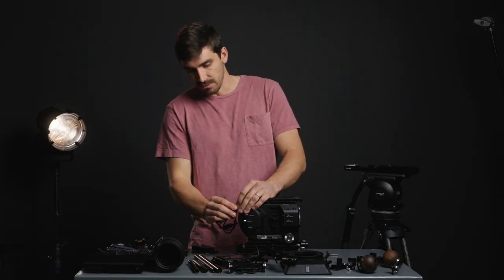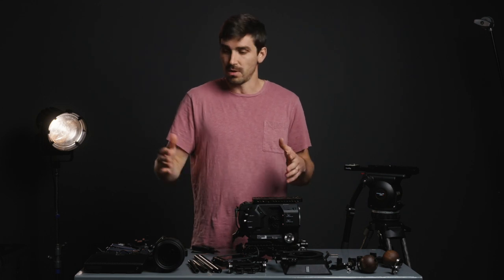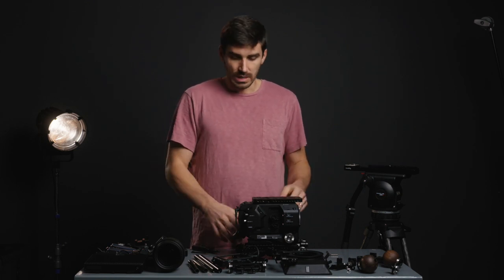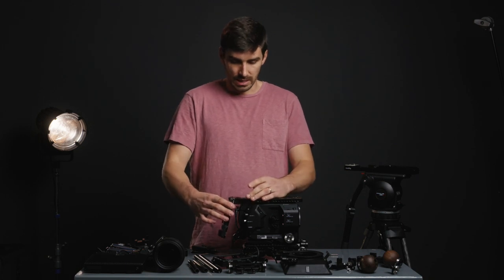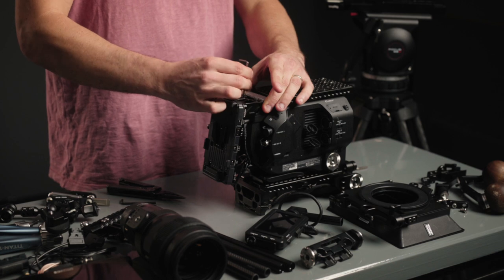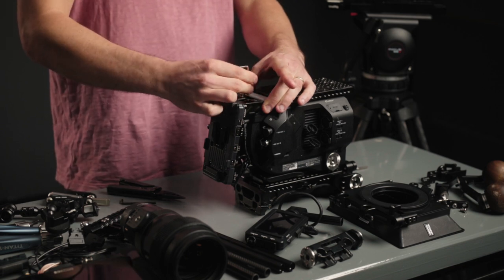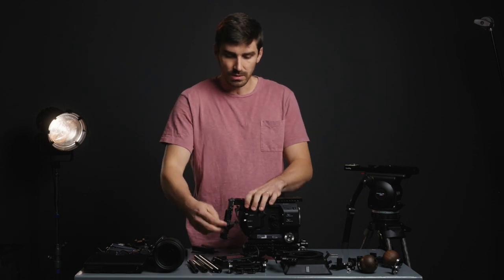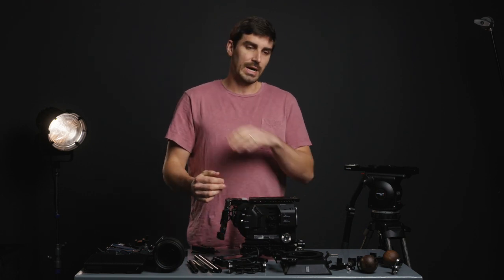It was a couple of years ago now where I transitioned from normal batteries to V-mount batteries, and V-mount batteries allow me to run everything off of them — my monitor, a wireless transmitter, I phantom power a microphone. A V-mount gives me a lot of energy with D-taps out and I don't have to worry about power. So the next thing I'll do is add this V-mount adapter for the FS7. Like I said, none of these are specific — if you have a C200 or an EVA1, there are all sorts of V-mount adapters for your camera. It also adds weight to the back of the camera, which helps on an easy rig for a more stable shot, and counterbalances your lens for shoulder work.